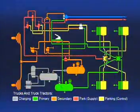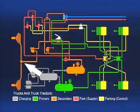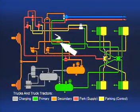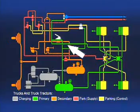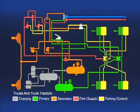The QR1, most often used on the front or steering axle brakes, speeds up their release. Because the driver and the brake valve are relatively close to the front brakes, the time to supply those brakes is very short. But the brakes farther away require help from a relay valve. Use of this valve on rear axle brakes, particularly on long wheelbase vehicles, assures simultaneous application of the front and rear brakes.